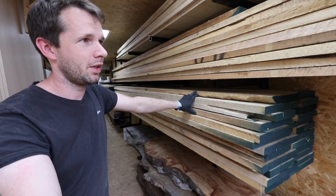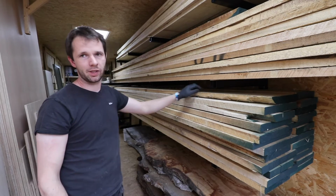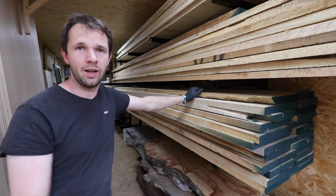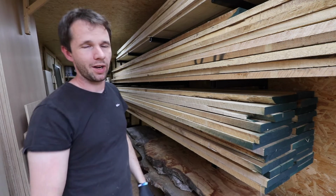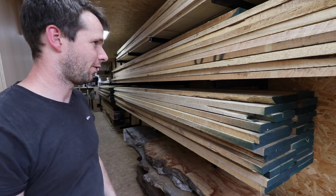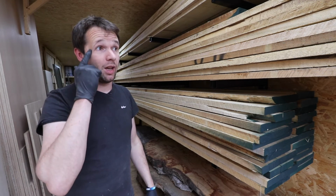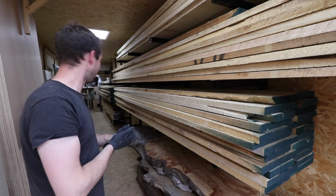So this has come straight from James Latham, the timber suppliers. It's sold as kiln dried, around 15% moisture. So we're going to leave it in here with them machines going. I'll empty it out every day and keep a note of how much moisture I actually pull out before them machines settle down to a constant value like I had before I put the timber in, and we get a good idea of how much actual moisture in a volume is in the timber when it comes from the supplier to what state it ends up in when it goes into a house.